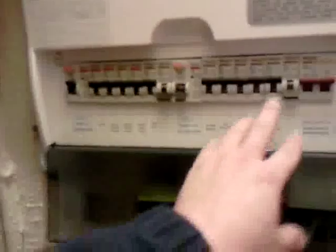If you have a single RCD board with just one RCD powering several circuits to the left and a main switch powering several circuits to its left, it still complies with regulations providing that the socket outlets are on the RCD side of the consumer unit. If there are any major changes to those circuits — cables buried to a depth of less than 50mm in a wall without metallic covering or metallic sheath — then they will need to go on the RCD side, what we call the secondary side of the distribution board. The only way around that is to ensure cables in the wall are buried at least 50mm deep and are steel wire armoured, as that has a metallic sheath. That isn't practical these days, so hence all circuits in a residential dwelling are now RCD protected.